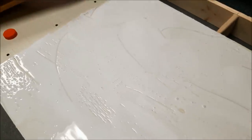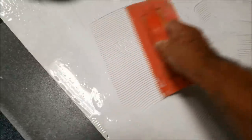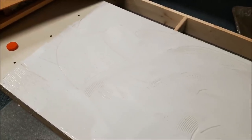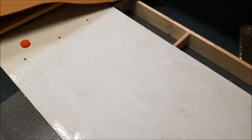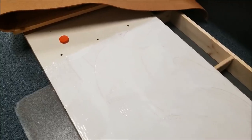You're going to have to trial and error to get this right. You have to have a pretty good coat of glue on here for all this to work. We got all the glue on and spread it out. Gotta work fast. We've got a wet rag so we don't get any on the carpet. Now we're going to put the cork on, then clamp it and I'll show you how we do that. I'm by myself this morning, so I can't record the placing of the cork. All we're going to do is make sure we have it straight with the front edge.